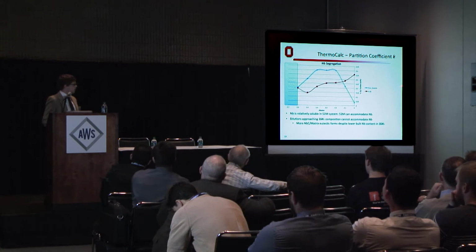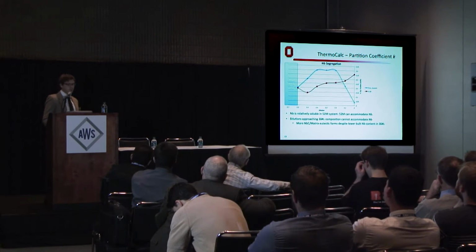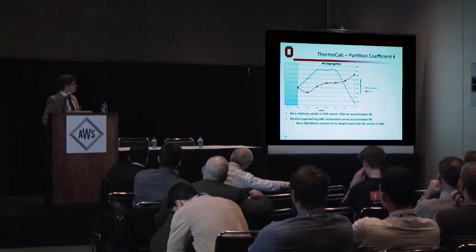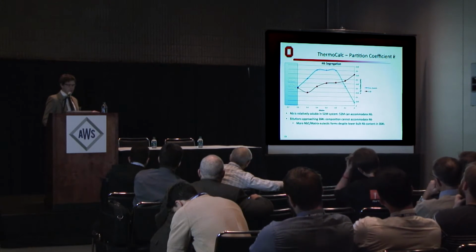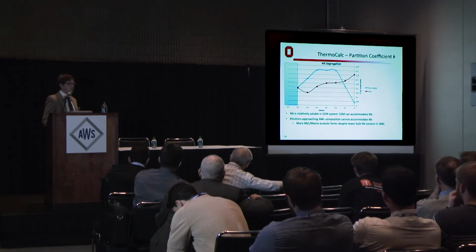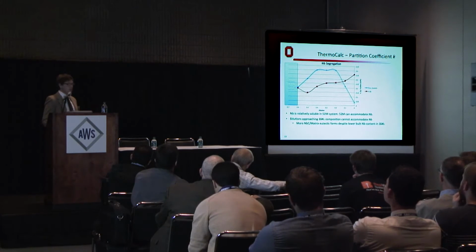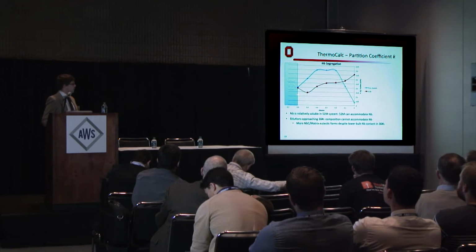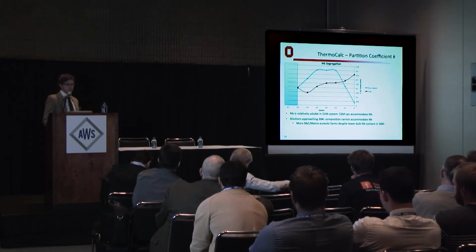However, dilutions approaching the 304L composition, even at very low dilutions, cannot accommodate niobium. And the eutectic forms at higher phase fractions, even though the 304L system has much, much lower niobium in it. Going by the EPMA results, this niobium level in 304 is on the order of 0.02 weight percent. So even though 304L, approaching 100 over here, has much, much lower niobium than 52M does, it still can't handle niobium in the matrix, and therefore it partitions more niobium, as evident in this more extreme K value. And so the fraction eutectic goes up as dilution increases.